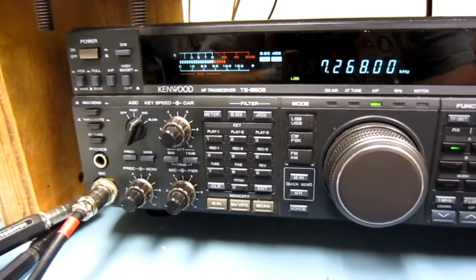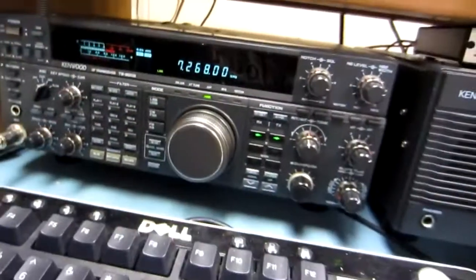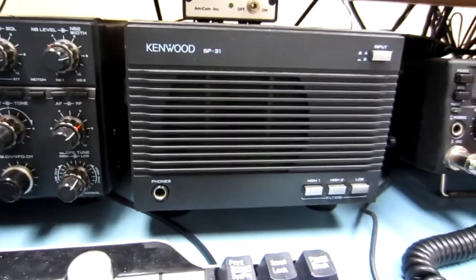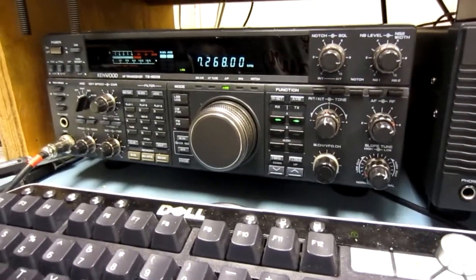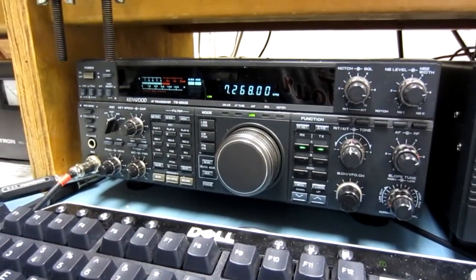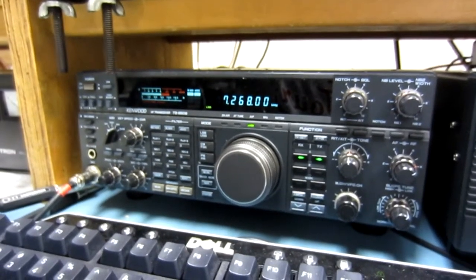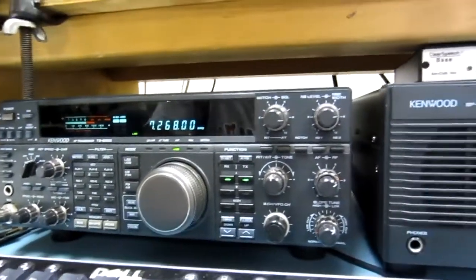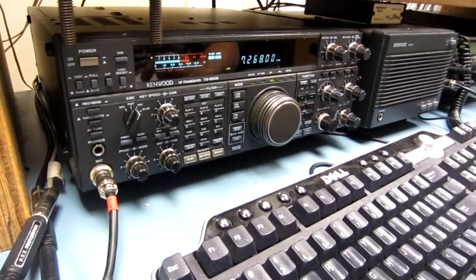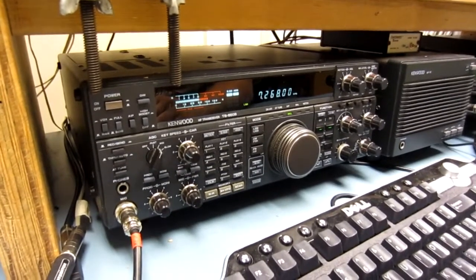Turn it back on flat again. I have to experiment around with this. I've got a little Behringer mixer here with ferrite beads and ferrite cores, and set up a little test rig that they described in QST for tuning those to figure out how many turns will block what frequency using this antenna analyzer that I've got, and it seems to have worked out pretty well. However, I did have a problem with the antenna — in one place it would tend to completely deafen the Wi-Fi router, which is not too cool. My son is not cool if I completely knock out the wireless. Those are maybe 8 or 9, 10 bucks from Amazon — that's about the best place I've found to get them. Seems like eBay and those places don't have them unless they ship from the UK, and the shipping bills are from there.